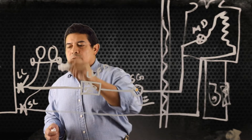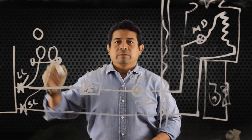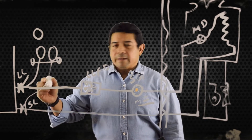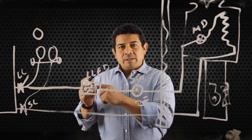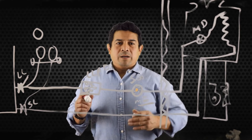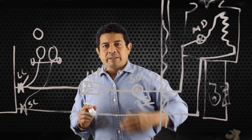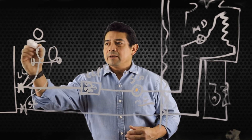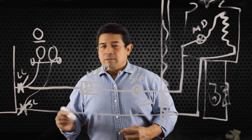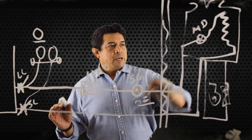We're going to see that the pressures on the gauges drop down to zero — zero PSIG — and that's what we want. Once we see it at zero, we let go of the contactor. The pressures might go back up a little bit; if they do, you just push the contactor in again and drop them down to zero. Once they stay at zero, we close off the suction line service valve, and the system has been isolated.